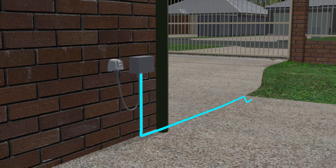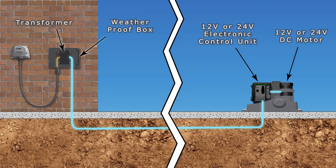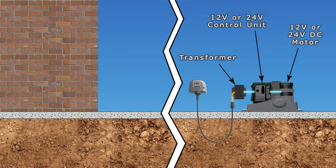If you want to know more about running low-voltage cabling, please visit our website — links can be found in the description below. Motors that have this option are generally 12-volt or 24-volt DC, meaning the electric motor that does the mechanical work is a low-voltage DC motor, not a mains-voltage AC motor. If it is a mains-voltage AC motor, you will need mains power at the gate. Low-voltage motors can also have a transformer built in, so they can be powered by mains voltage at the gate too.